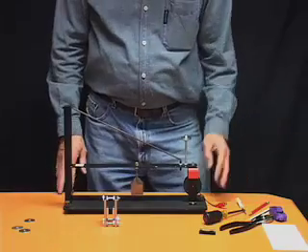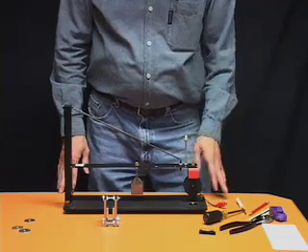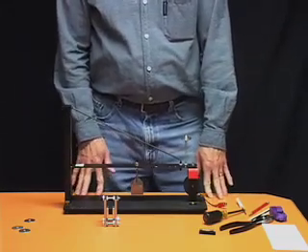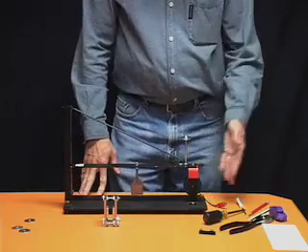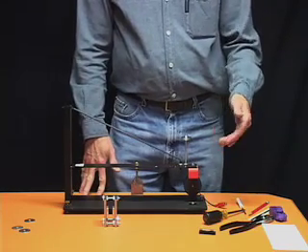Well, that may be because it's touching. If there's the slightest bit of friction between the magnet and the coil, you'll still see some deflection when you lean on the table or do something equivalent to a huge earthquake. But when the very small waves actually come from an earthquake, it won't respond because of that friction — it can't get moving.